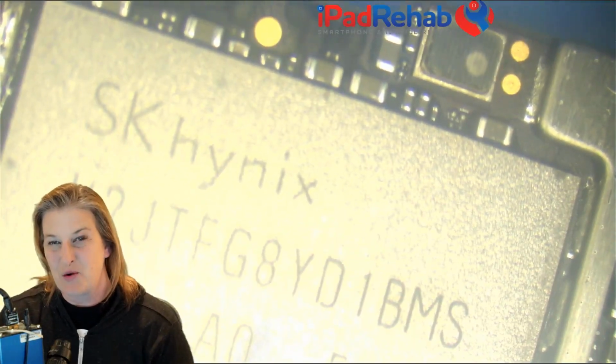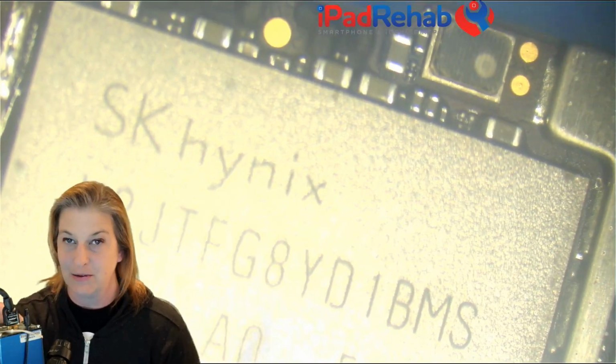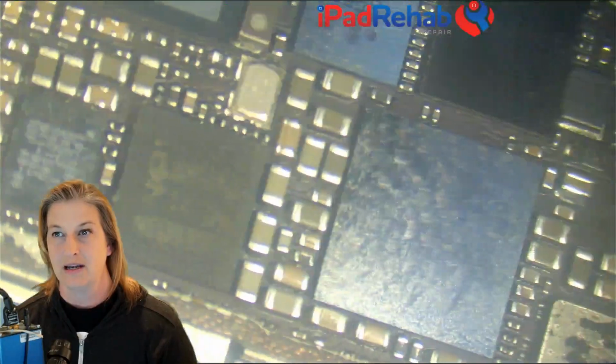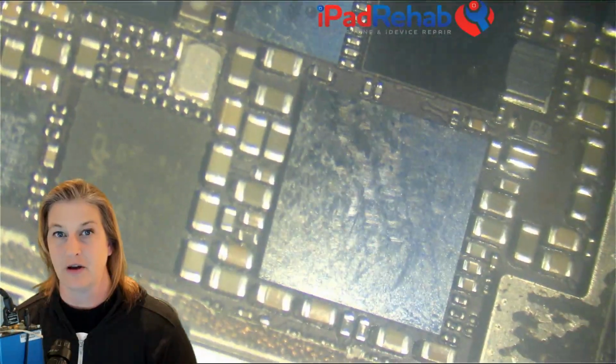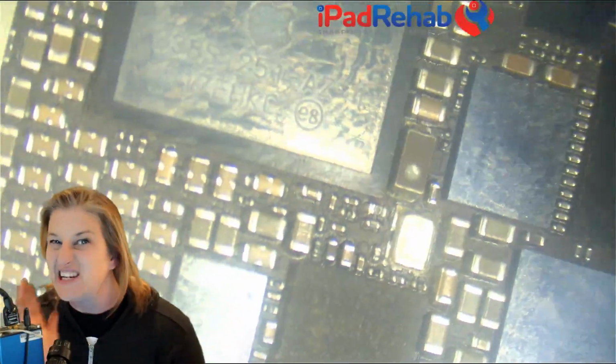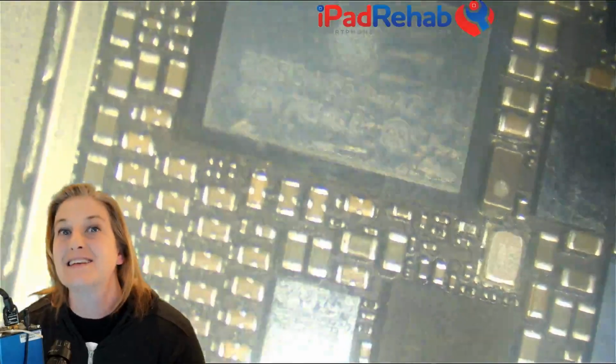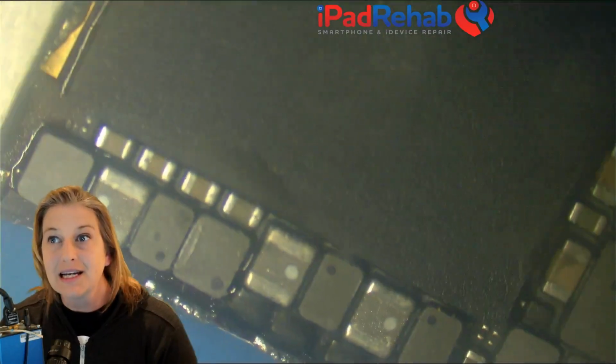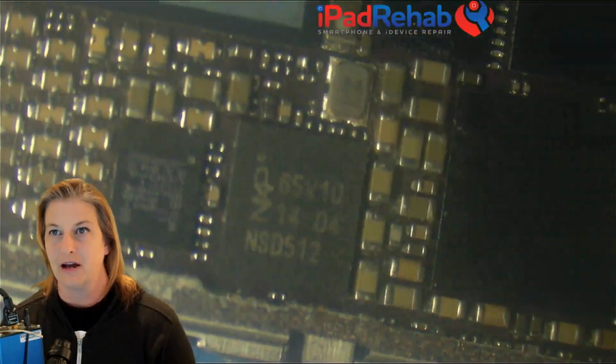I can see a little bit more looking down through the oculars than you can output to the screen. So we'll say, well, let's look around in this area just so that we can get better information for you guys. But really, we would be able to see this entire board. Now, from our face, we know, hey, let's look on this side of the board rather than the other side first. Although the shorted line could be anywhere, and the guy that actually gets hot isn't necessarily the cause of the short, but we're gonna go with this for now.